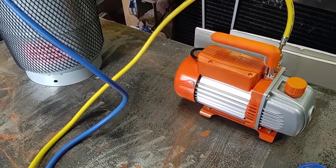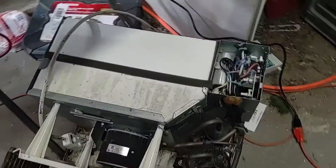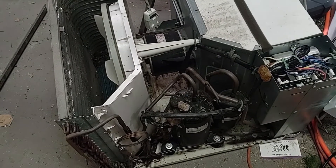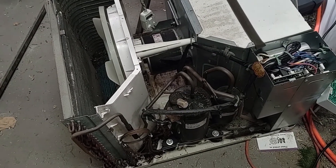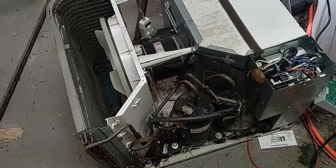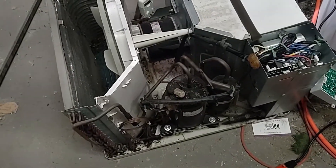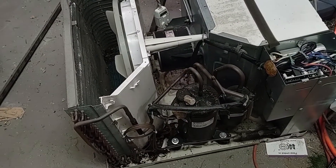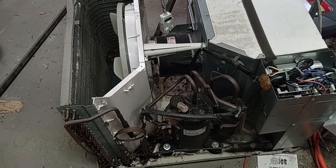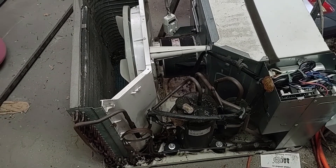I do have one more test for this. I'm working on a window air conditioner — I'm actually going to split this into a split unit and disconnect the compressor, condenser, and evaporator. If you're interested in checking that project out, subscribe to the channel and check out my other videos. After I split the system, I'm going to be filling it with nitrogen, and I'll run the vacuum to pull that nitrogen out after all the copper tubing is reconnected.